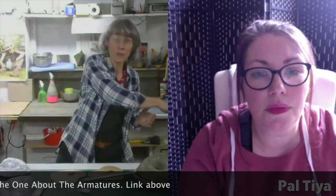You're going to have to pound in grooves as additional supporting ribs. So it's thicker. You're not going to get away with that thing being 3/16 of an inch thick this big across. You're just not going to do that. So you might have to put on a scratch coat with ribs, and if it's this big, maybe even a second one. You're going to need to get that thing up to at least half an inch if you want it to be self-supporting over a big piece.